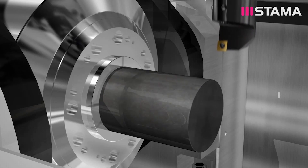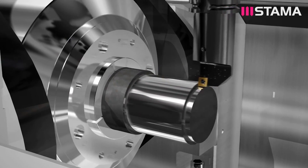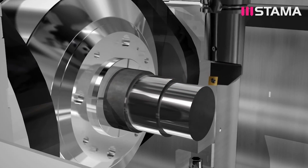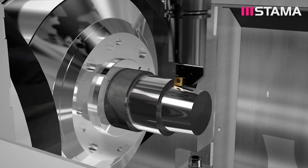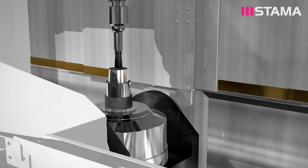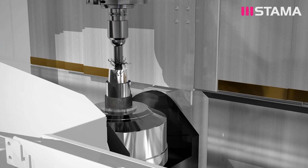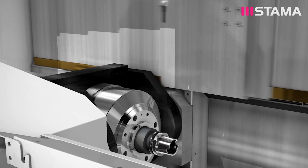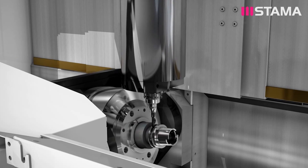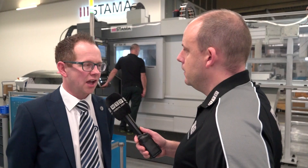Taking the first spindle into account, you're bar feeding into that spindle and then machining on it in a horizontal plane, and then you might tip it through 90 degrees to do a secondary operation. Yes, you can have a bar length of up to around 800mm with this machine tool, which allows you to use the tilt of the spindle to come in vertically as well as horizontally, giving you full five-axis machining capabilities.